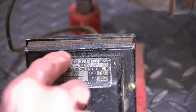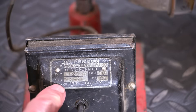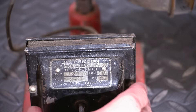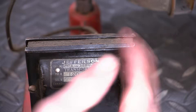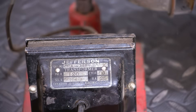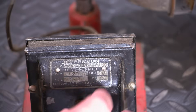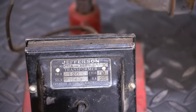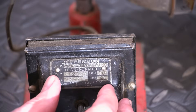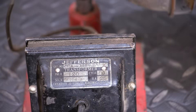The catalog number is CSA-1124. Secondary volts: 6.5 volts. There's a nice little punch mark for the decimal. 120 volts, 60 cycles, and volt amps: 25. A product like Vim would clean this up further, though you'd have to be very careful — a solvent-based cleaner might take the paint off, and I wouldn't want to do that. This transformer looks like it's in very nice condition.